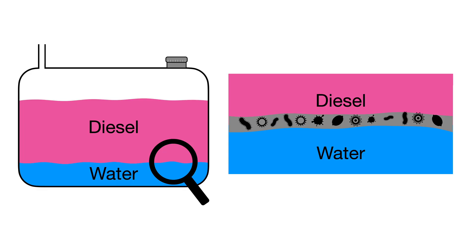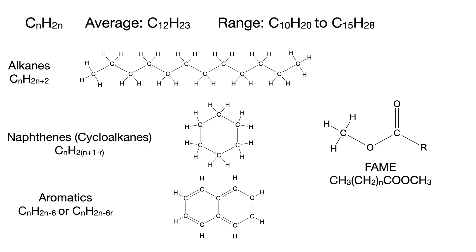These microorganisms grow for about 48 hours, forming a biofilm, and when they die they sink to the bottom forming a blackish sludge. So what may be going on in my tank is diesel bug — bacteria, fungi, and other organisms growing at the diesel/water interface — producing a sludge that somehow gets through the filters and into the engine, causing problems.